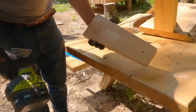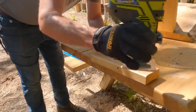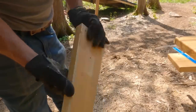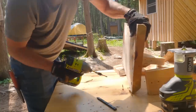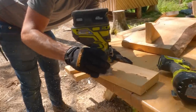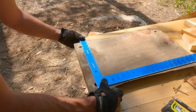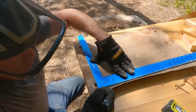That's going to be sweet. I guess if I don't route this while I'm taking it apart, I won't know which sides to do. Looks far fancier, doesn't it? Then when we plane it, it'll be real pretty. Who made this thing 10 and 3/4 inch apart? I wonder how I chose that. Well, we're going to make it 12 and a half — that's about as big as we can do to fit it through the big planer. It's a 13-inch planer, so let's see if we can fit 12 and 3/4 in there.